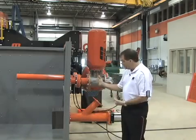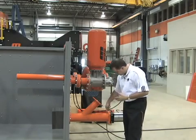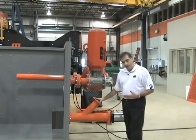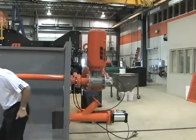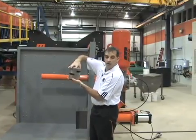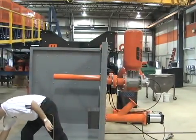So we came about to produce an air cannon product that could do this without damaging the refractory but be able to protect itself from these harsh temperatures — that's what we have here in this retractable nozzle. If you look at it from the outside, you have a cylinder — the same six-inch, 150-millimeter cylinder we use in our multi-port product — and what it does is drive a tube inside of this y-shaped tube. You've got your cannon that mounts here, and the cylinder pushes a tube which has a head on it with four holes — a quadridirectional nozzle.